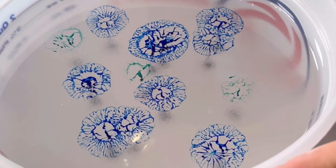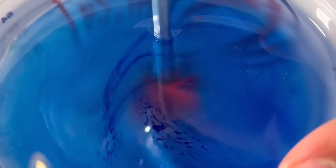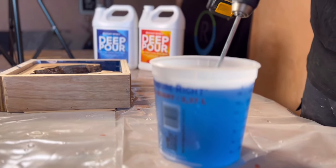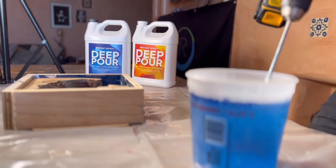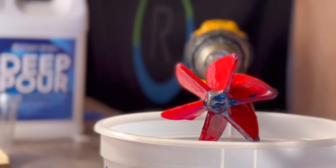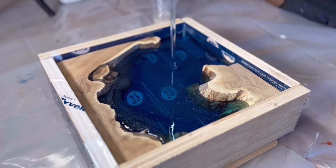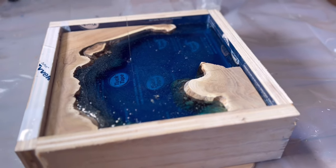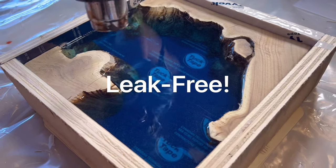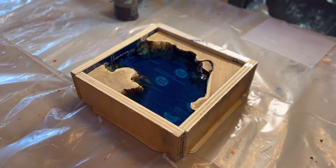Quick checklist: tape your mold pieces, assemble them, silicone all the ends and joints, and if you want to go the extra mile silicone the bottom as well. That way when you're ready to mix your epoxy you can pour with the peace of mind that you won't get any leaks, waste your time, waste your client's time, or waste money. Check this out — we just poured over two and a half inches of deep pour epoxy, completely leak-free.